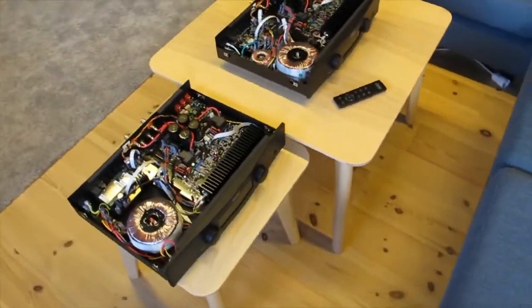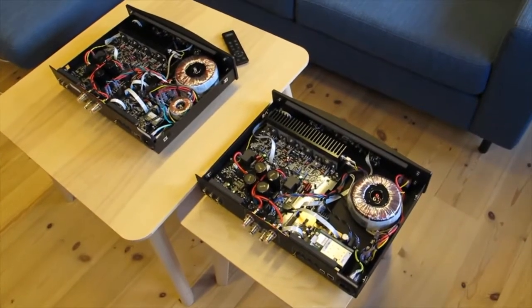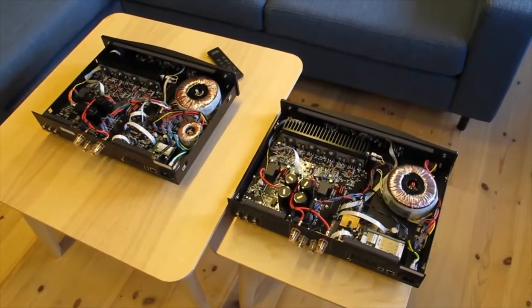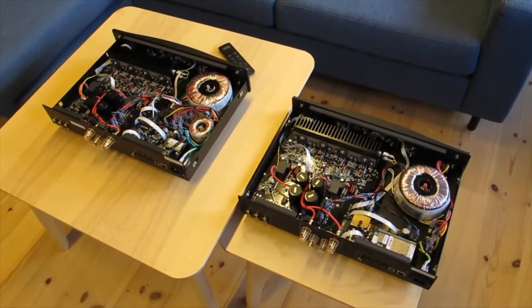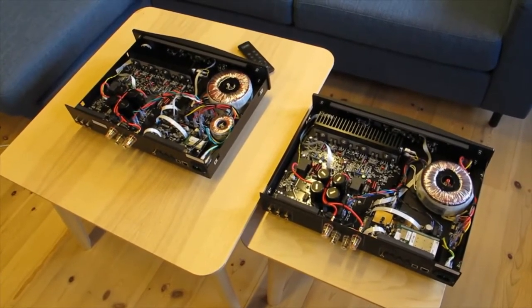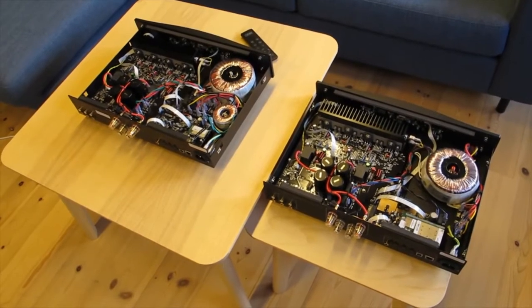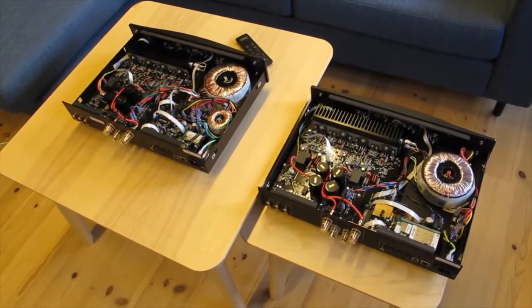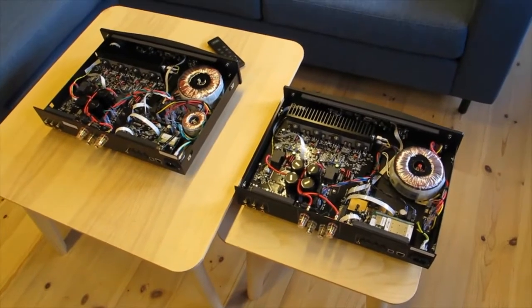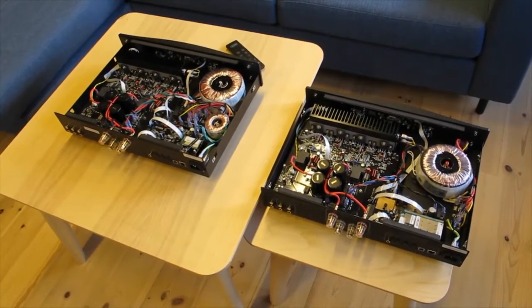If you look at the amplifiers from the inside, they also look very much the same, at least in principle. They both share something we called Hegel Platform 1 or H1. We designed that way of making an amplifier, meaning basically where things sit in relation to one another. Where is the power supply, where is the output stage, where is the preamp, and so on. And we made this back in the 90s for an amplifier called Hegel H1, and it was later also used for the H100, H70, H80, H90, now the H95 and the H120 and H190, and also H160 now that I remember it. So even if they're not the same, the basic placement and topology inside is much the same.